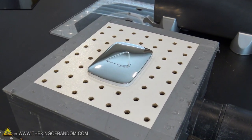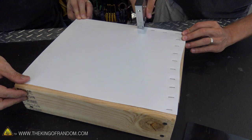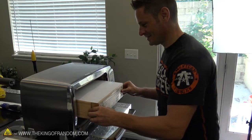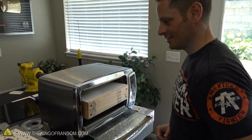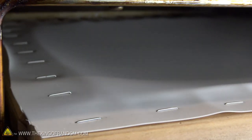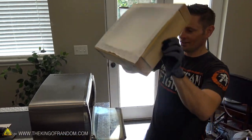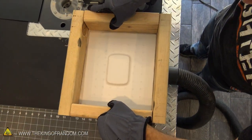Okay, so here's the idea. We got our button reinforced. It's going to go on top of the vacuum former. We're going to get a little bit of plastic, staple around the top, put it in an oven and warm it up until it gets saggy. Then we're going to flip it over, put it on top of the play button, and turn the vacuum on. Well, look, it's already starting to get soft in here. You can see around all the staples it's starting to wrinkle. You ready, John? Standing by. Ready. Here we go. Initiate suckage.